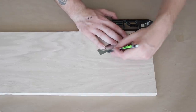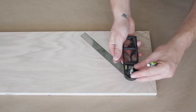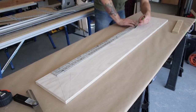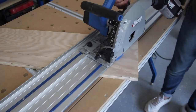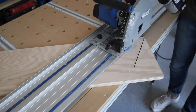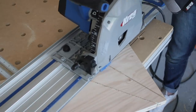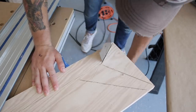To lay out all of the lines for the base, I'm using a tool called a multi-square which costs about six bucks from Harbor Freight. This is really the simplest, most tasteful mid-century base that I've come up with and it only relies on 15 and 45 degree lines. Diagrams for all this will be included in the plans, but really all you have to do is make some angled lines and connect dots. I thought that since this video was sponsored by Kreg and I was using the ACS to break down all of the case work, I could try it on the base as well. It's such a different way of breaking down and cutting material, and turns out it was great. I was able to use the track saw to cut right up to each intersection and then I just used my Japanese pull saw to cut the remainder of the material to give myself a really clean corner.